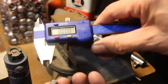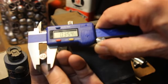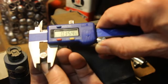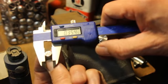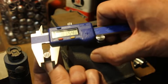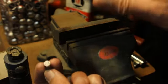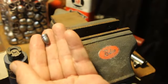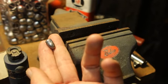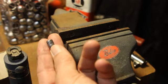Now we want to take our calipers and measure your cast bullet. You've got .3545, or say .355 inch. What that means is your best cast bullet diameter is .001 over that, or .356. If you have .3565 or .357, that's good, but no bigger than .357. Your .356 or .3565 would be perfect.